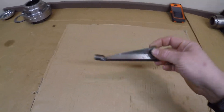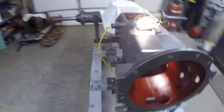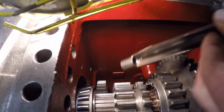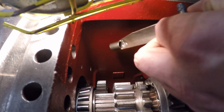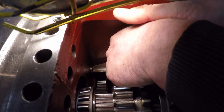So hopefully now it makes perfect sense how this little trough ties into the cap that goes over the end of that pinion shaft down here. That cap is in place to prevent drain-back that would happen from this front compartment being at a higher level than the rear one. You can really see the difference when you look at the level plugs on the side — this plug up here is for the torque amplifier compartment, whereas this plug down here is for the transmission and rear end. So that little trough goes a long way towards making sure everything gets the oil it needs.